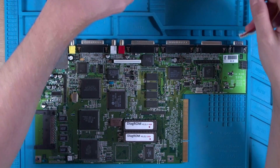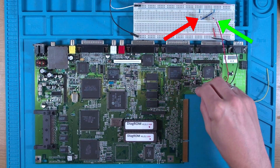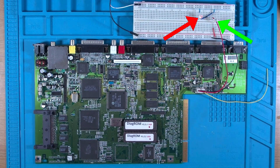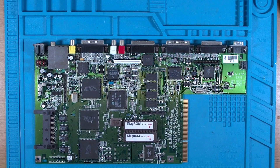I've built a little circuit here with two LEDs — one red and one green — which I'll connect up to the 5V and ground of the floppy drive connector. Whilst there's a short on the board, the red LED will light. Once the short has cleared, the green LED will come on instead. This gives us a nice visual indication if we clear the fault as we remove the capacitors.